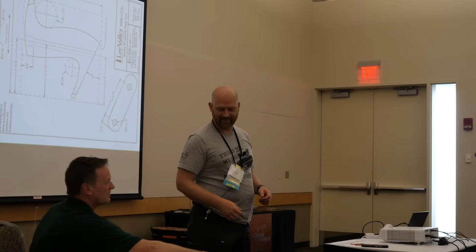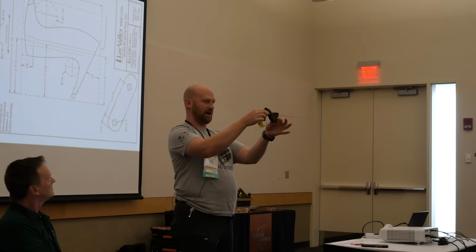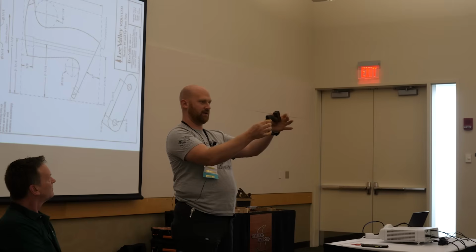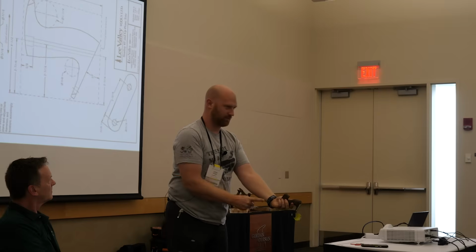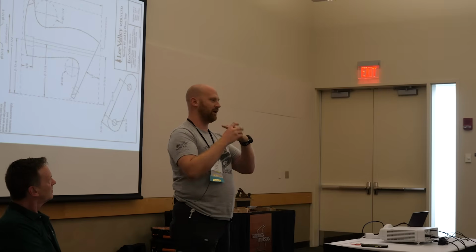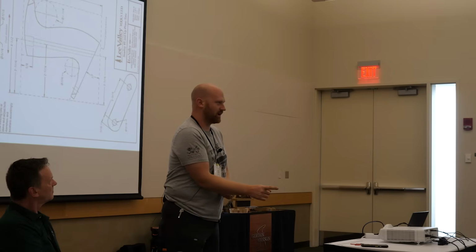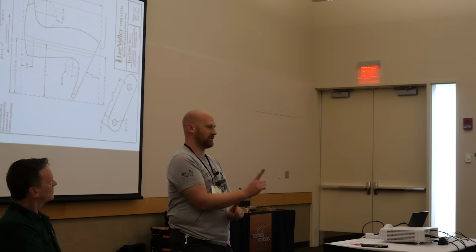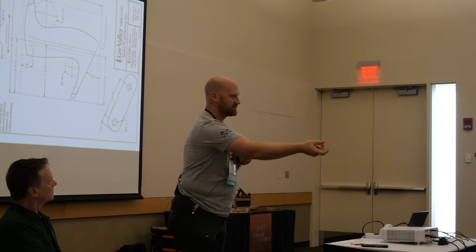You clamp it sideways, right? Yeah, I'll take the handle and turn it this way and clamp it in the vise that way. And I'll have it down at my stomach and put the brace into it. And then on the brace, I actually take my wedding ring off and put it on the shaft. So as I'm drilling horizontally, if I drop down and start boring up, the ring slides back to me. If I go up too high, the ring slides away from me.